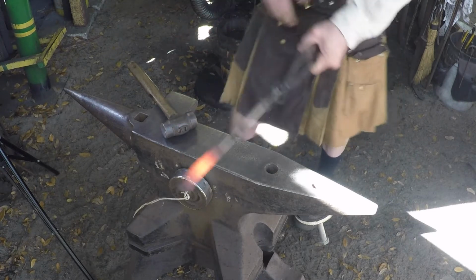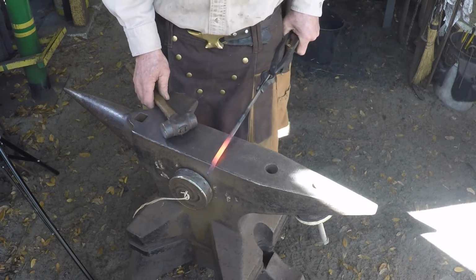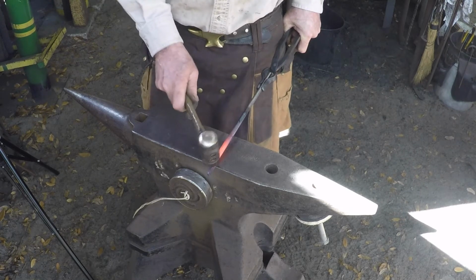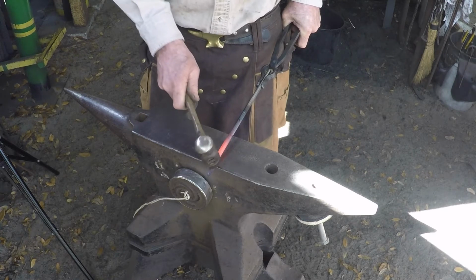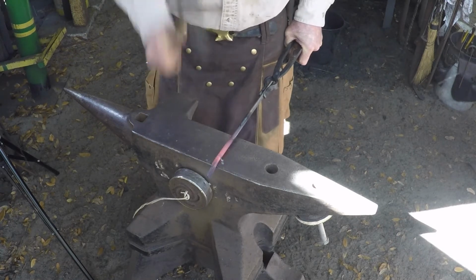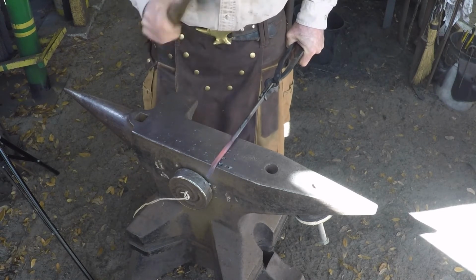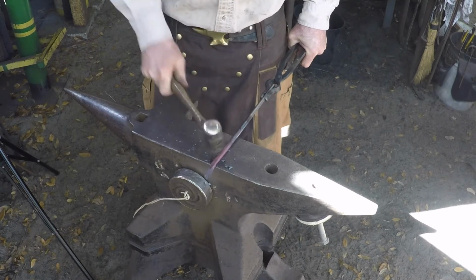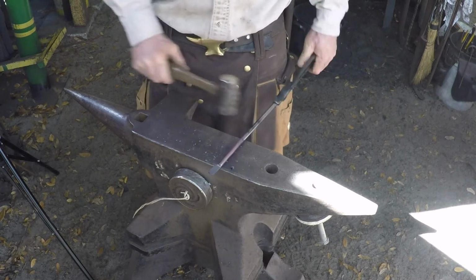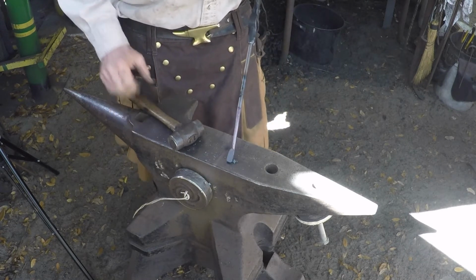Okay, what you're going to do is come here, turn it left, and then kind of hook your jaw. You'll feel it right there on the edge. Do the same thing you did here. Tilt it just a little, set it down half and half. And then when you lock, you can kind of tilt it back. I'm coming back about 3 inches. All right, and you can see this is still well over a quarter, close to 5/16.